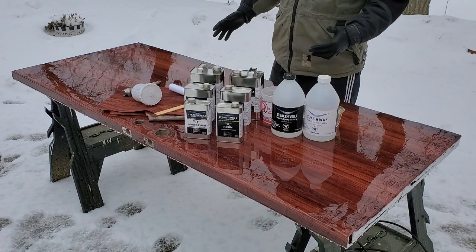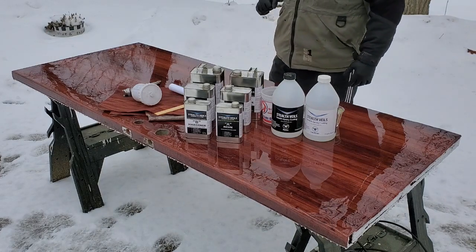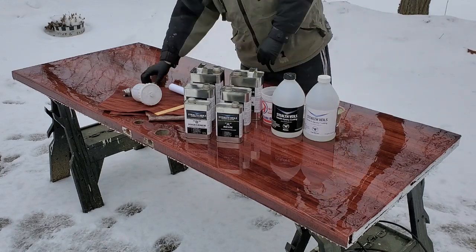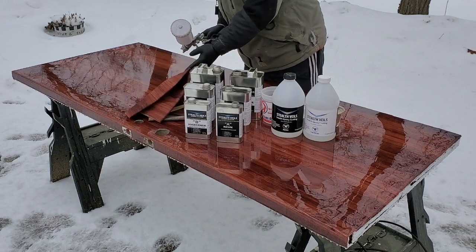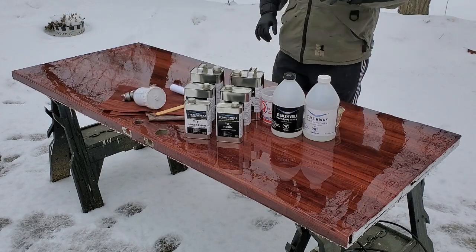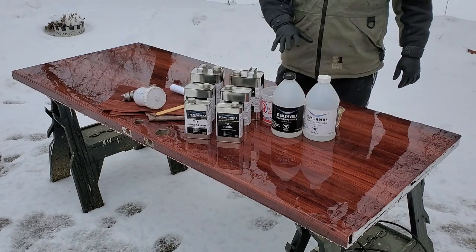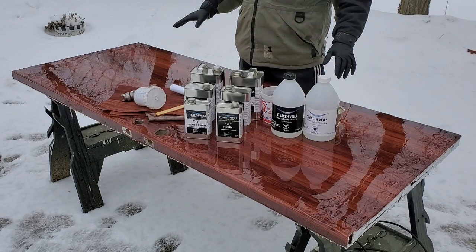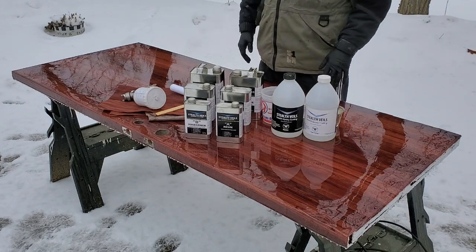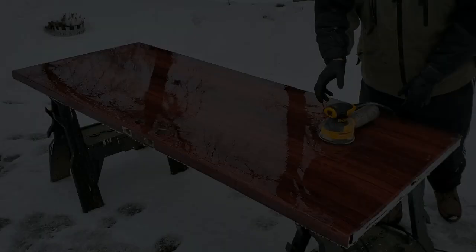In this case, what we've done is we've got our steel door here that we took off the garage. We painted it with a Behr paint and primer. We used a Loctite spray adhesive. We applied our Batuk Tropical wood grain veil. Got it all down, got the wrinkles out of it. We used our 1:1 stealth coating epoxy to do a 2 ounce per square foot saturation coat to wet the veil out. Came back 6 hours later and did a flood coat with 3 ounces of material, let that dry, and here we are. Okay, we're ready.